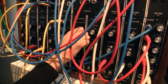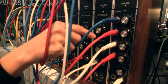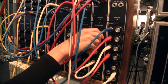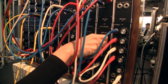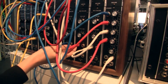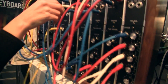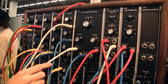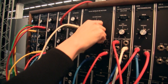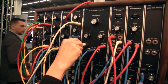As you can hear, the pitch is going up and down, or you can edit it over here with the single oscillators in the frequency range. They are all going here — sawtooth, sawtooth, sawtooth — into the mixer at the moment. And from the mixer it goes up to the filter section. This is a classic Moog-style ladder filter, right? Exactly. And it's subtractive synthesis.